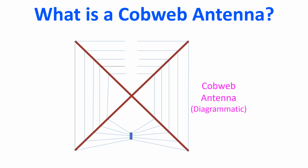Cobweb antenna requires only one support and gives performance like a full-size dipole on 5 bands: 20, 17, 15, 12 and 10 meter. Moreover, it can be fed by a single 50 ohms coaxial cable. It has a horizontally polarized radiation pattern. There are 5 folded dipoles which are fed by a common balun. As it is an omnidirectional antenna, an antenna rotator is not needed.